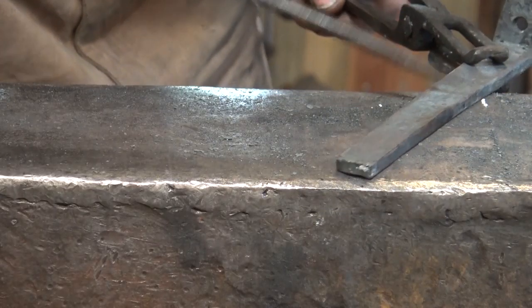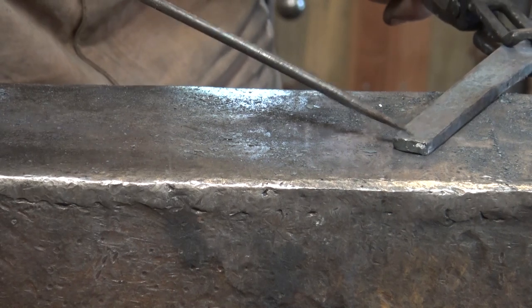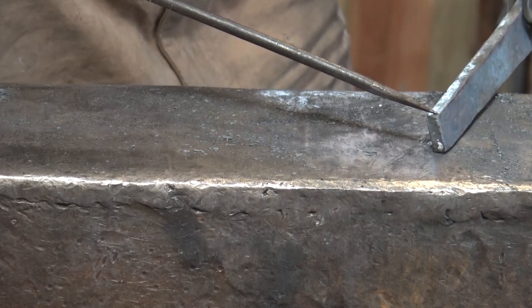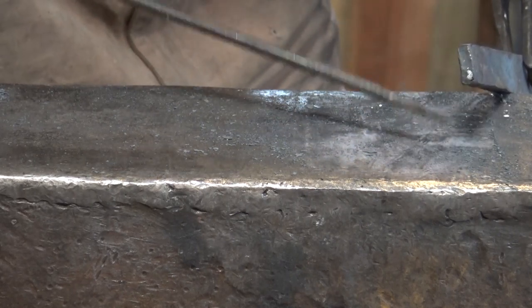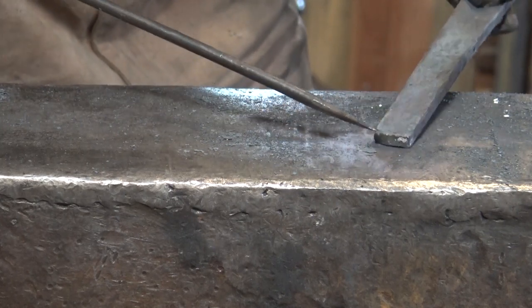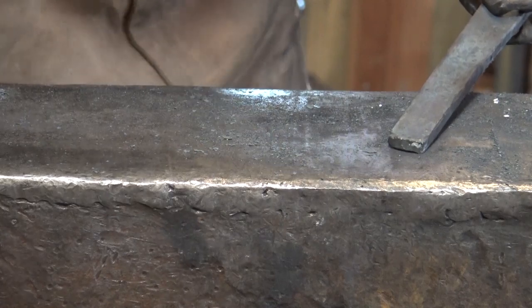The last thing is to make sure all legs have the same angle — it's pretty easy to straighten it out at the edge of the anvil, and you might make a sheet metal gauge or set a carpenter's bevel for precision if making many of these. The next thing I want to do is upset this end a little bit to make a foot and bend it back the other way so it has a nice stable foot to sit on — that increases the overall diameter where it sits on the ground. I realized there's a simpler way than upsetting in the vise then bending separately: if we just go to the anvil and make the bend at the edge of the anvil and work it like a square upset corner, the end of the foot will upset all by itself.